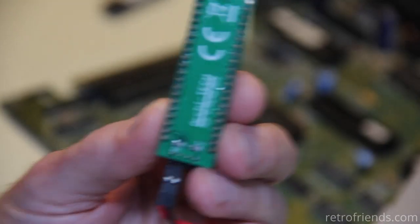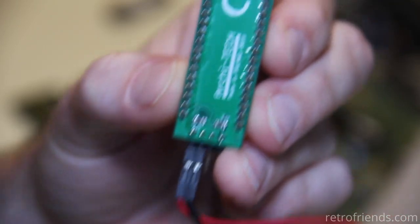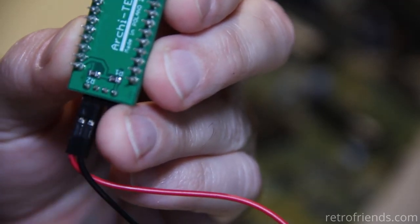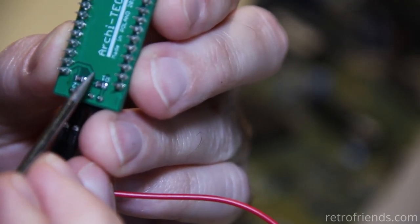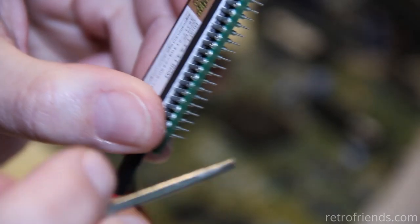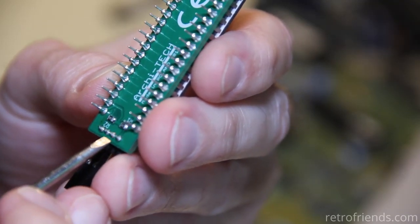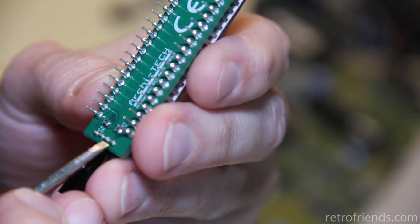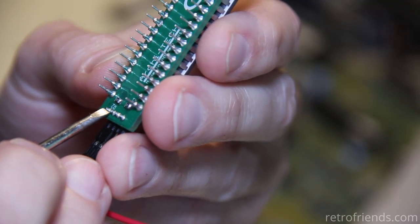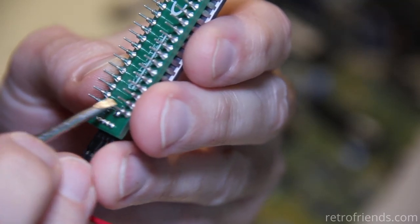Let's take a closer look at this. The two middle pins are grounds, and then we've got these two resistors hooked together with this lead here. VCC is on the bottom right of the socket - so these are pull-up resistors. On the other side of this board, I don't really see a connection - this is only where it's pulling up - and there's a via right here and another via there.